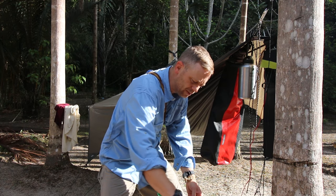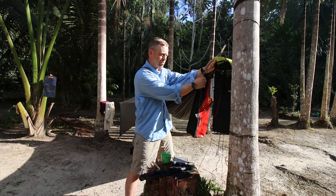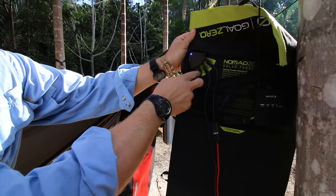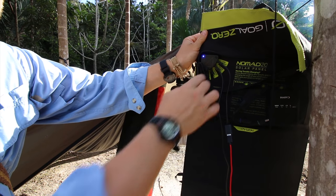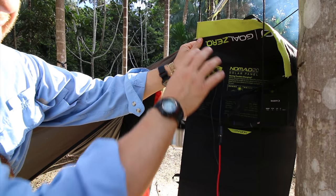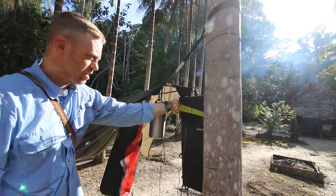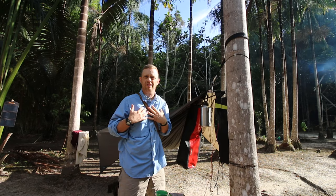Here's Joe's phone charging on the back. If you look right here, there's a whole bunch of little ports and they're all really well labeled. This is the mini solar port for legacy smaller attachments. This is another solar port for chaining — the in-port to add another solar panel. This is the power cable that's right now going to the Sherpa 50. And then there's a little USB port. So this panel is charging a USB port and the Sherpa 50 simultaneously. With this kind of sun coverage, the Sherpa 50 will go from zero to full in about four to six hours based on past experience.